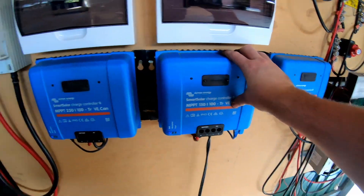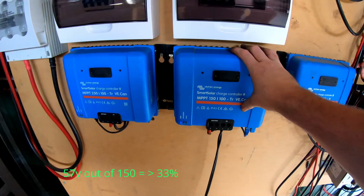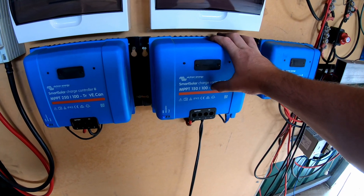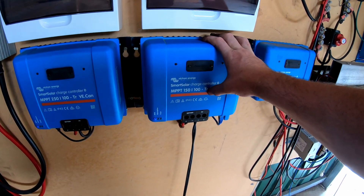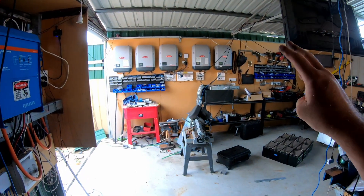For these, they have to be five volts above the battery to fire up — that's when they start charging. Once they come down from five volts above the battery, it doesn't matter — they could be 0.5 of a volt above the battery and they'll keep on charging.